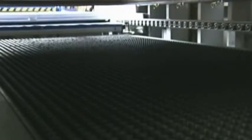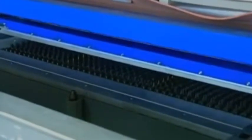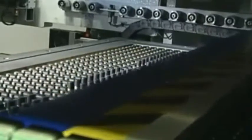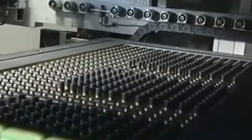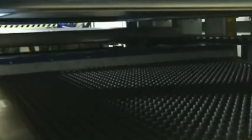The press features a lower moving platen bearing a large number of vertical pins, each of which has 2 height settings. The control bar, which moves specularly to the reading bar of the feed unit, moves them into the up position corresponding to the discs occupied by the panels. As the press comes down, the pins enter the tray discs corresponding to the panels actually present, thus forming a support that is raised with respect to the remaining surface of the tray.